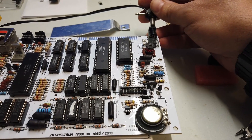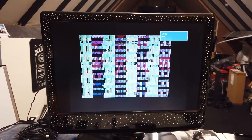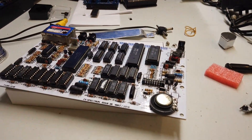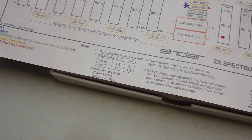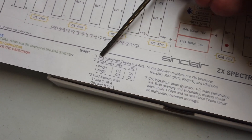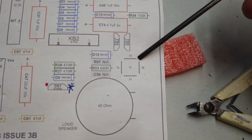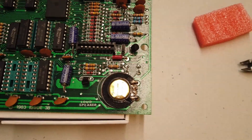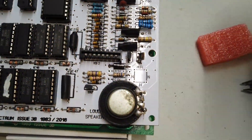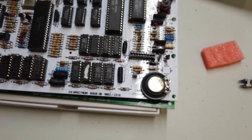No heatsink — come on, baby. I want to see Sinclair written on the screen when I plug you in. No! It's not the ROM! I may be onto something here — ROM links. There are NEC or HIT links, and over in this corner we've got these ROM links and it looks as though I haven't done that. On the working PCB there are ROM links in place for NEC. I, the muppet, have neglected to install those ROM links on my PCB. Let's get those ROM links installed and just maybe we might end up with a working Spectrum.